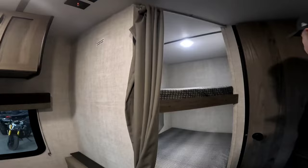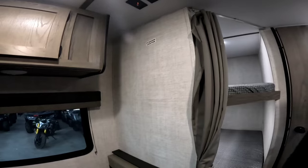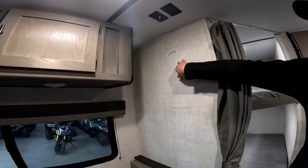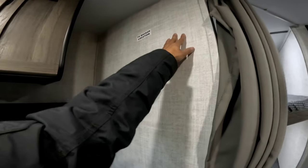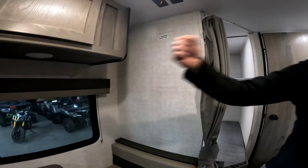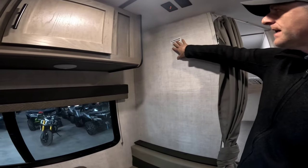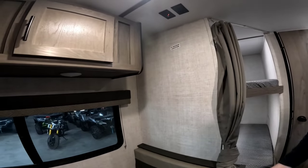And if I'm gonna put the bracket for the TV here, how are we gonna install it? How you would install it in any household. Is there any hardwood inside there too? Yeah, that's why they have that here. Just make sure you don't use really long screws. It's all hardwood here. I'm planning to put a 32 inch TV bracket. You can have the swivel brackets too. I'm wondering if it's the same as a house. That's why the backer location is here. They have a hardwood piece in this area. Just on that area? That's correct.